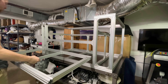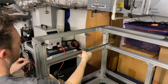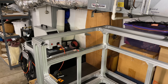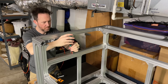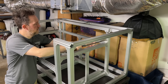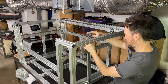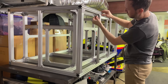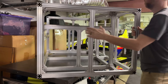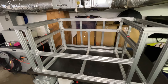Vasa went ahead and put together what will be the lifting table support. I've got these two 15 millimeter rails — let's go ahead and get them installed while it's convenient while these top beams aren't on here. I'm going to try to drop them in place for now and we'll get them aligned later. These are for the Y-axis — they're 700 millimeters long. The frame is done. It feels really rigid. I guess now I need to start milling out some parts so we can start putting together all the motion systems.